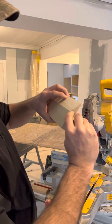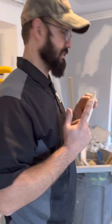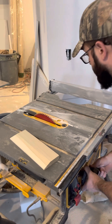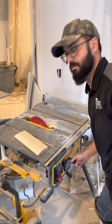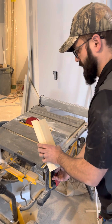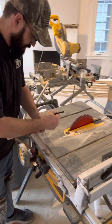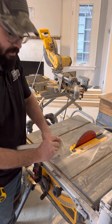The rest of this is an angle piece, so this has to be removed with either a coping saw or the table saw — and that's what I use. Just get the fence out of the way, we don't want it. We're doing this all by hand. Bring the blade up as far as it goes, and now we're just going to remove the material off of that 45 cut that we made. Make sure you don't go past this front edge here.